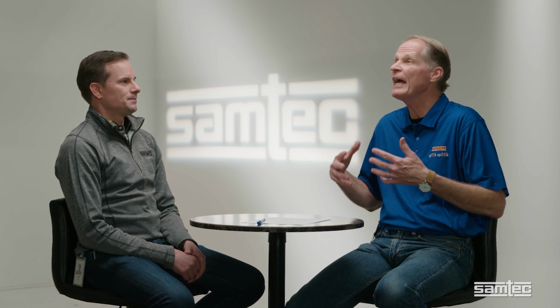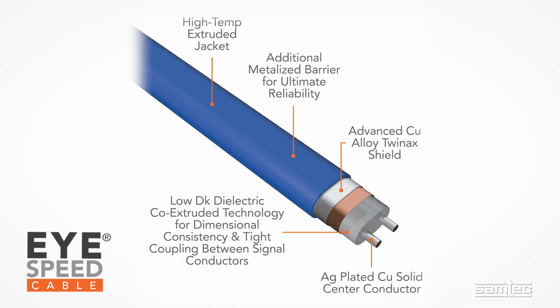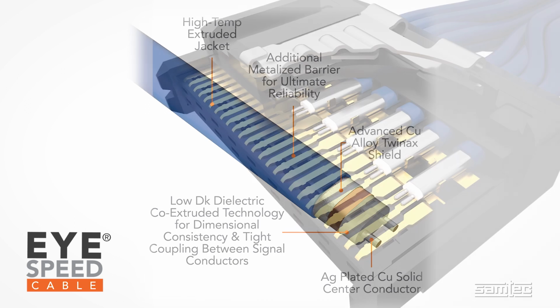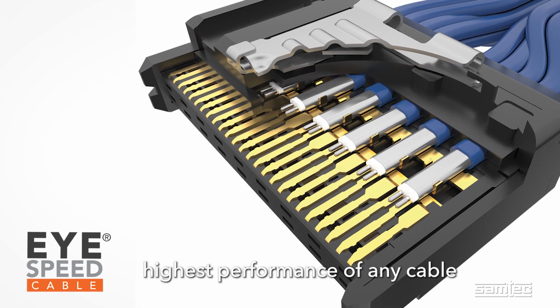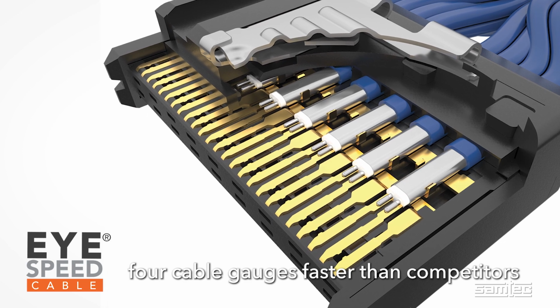Okay. Now, Andy, anytime we talk about high-speed cable assemblies, we have to talk about the quality of our twin-ax cables. Can you tell us just a little bit about this? Well, Danny, when I was in high school, I was voted most likely to talk about twin-ax. I bet you were. Well, go on. This is Samtec high-speed cable. Our ultra-low skew twin-ax uses co-extrusion dielectric technology, which improves signal integrity, bandwidth, and reach. Samtec twin-ax has the highest performance of any cable in the industry, typically 4 cable gauges faster than our competitors.